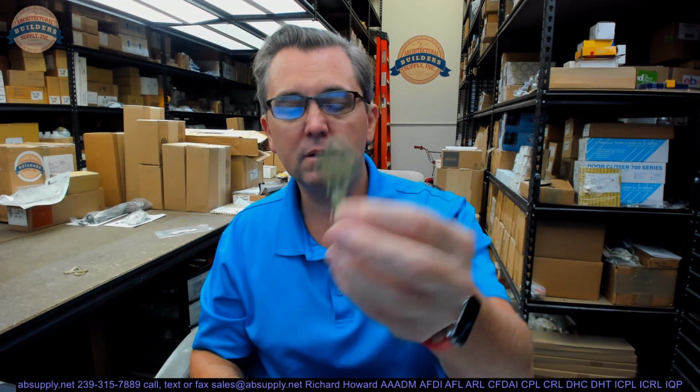Schlage most absolutely have products that do fill the need, the security need, where you just can't call up and order this key blank. There are restricted parts of Everest. This happens to be the open, the C in the S family, the S in the Everest 29. So why should you use this? It's because it's more secure, number one. And not only physically, but access to the key blank is less convenient. It would take more of a dedicated effort to get one of your keys copied.